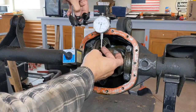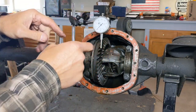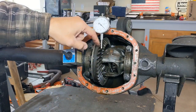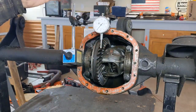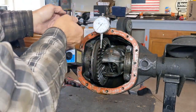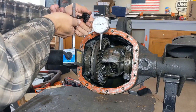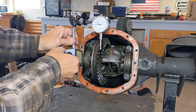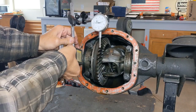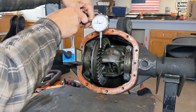I'm gonna take and raise it up a little bit, let it get over. Still have a problem here though, because the back side of this is hitting a tooth also. So to get this thing dialed in perfectly, no pun intended, I know, now I need to rotate this arm this way. So again, I can loosen this here, rotate it slightly out, and then I can also undo this, kind of get everything set up the way I want, put it back, and now I can loosen this, back it up into there just a little bit.